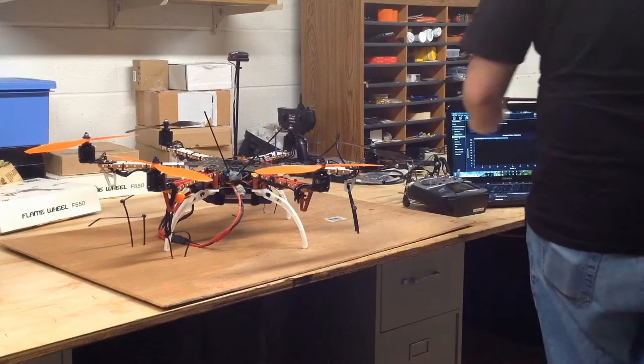It saves the values. I just wanted that to play out so you could actually see the compass motor calibration. It's supposed to compensate for the electrical interference of the current going through it like that. I do it every time I build a copter — an ArduCopter. I also thought it was funny — you never can tell if a box will fall off a shelf and crash down on you while you're doing something. It just vibrated off the shelf that day. I thought I would share that as a little humor, while also sharing the landing gear that was on the flame wheel with a viewer I'm messaging with. It's kind of a blast from the past.